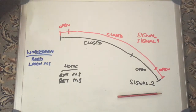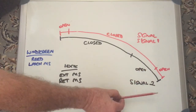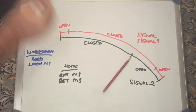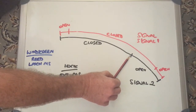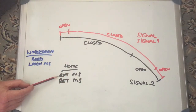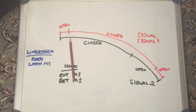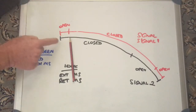Also from the hall sensors in the motor it knows it's fully retracted and can turn the whole system off. When opening the roof, you pull the switch in the cabin, it starts motoring up, and what I've noticed is that at about this position it starts to extend the hook. I'm assuming that when opening or closing the roof it's waiting for the position signal from signal two to say 'now extend the hook.' Immediately the rear BCM starts to extend the hook and waits for the extension microswitch to confirm it's fully extended. I think when it gets to about this point it's waiting for that extension microswitch before continuing, and if it gets just before the windscreen without that confirmation it'll stop completely.